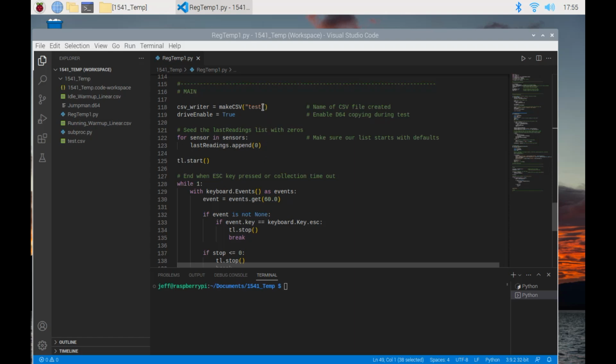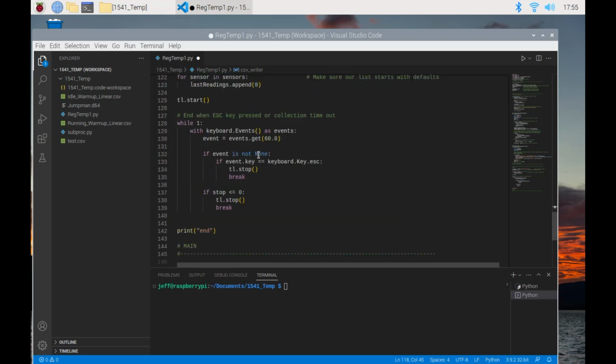And down here in main is where we set our file name, so we probably want to set this to something like running warm up switch. So our drive will be running and we're monitoring the temperature as it's warming up with the switching regulator. Drive enable true. If I want to run the same program without actually running the drive, we can set that to false, etc. I'll post all this on GitHub. There'll be a link in the description.